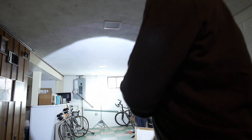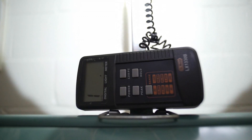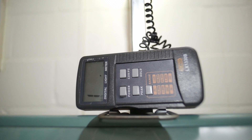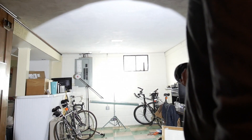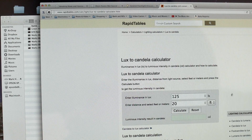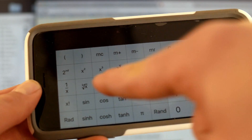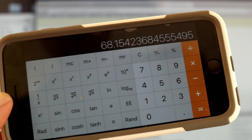You have to shine the light directly on the sensor this time, which is why you can't do this in your integrating tube. Mount the sensor on a wall - I have it on a tripod screen stand. I stand about 20 feet away; you can stand closer, but I like 20 feet because I can still read the meter from that distance and higher-candela lights have tiny hotspots that are slightly larger at this point. Put the center of the hotspot on the center of the sensor. Then go to a conversion website, enter your lux and the distance in feet, and you get your candela. To get rated meters, enter the candela into a calculator, hit the square root, then multiply by 2.